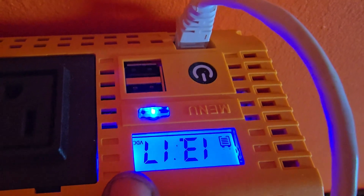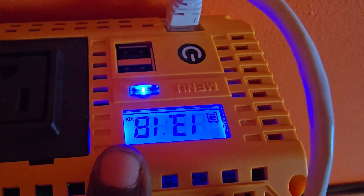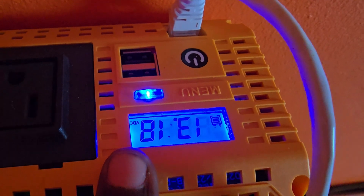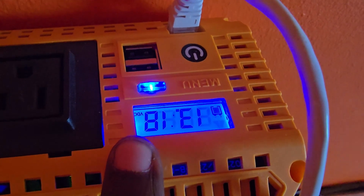The inverter display shows the voltage — in my case 13.18 VDC — indicating the battery level. If there's no error shown on the inverter display and no whining sound from it, then the inverter is not the source of the problem. In my case I was getting an error noise with no error indicator. If you have this specific solar system and are getting constant beeping, the next thing to check is your battery level — see if the battery has gone into a low state.